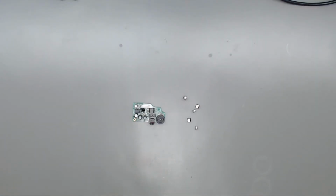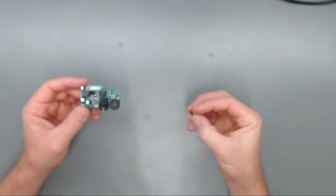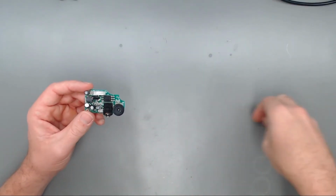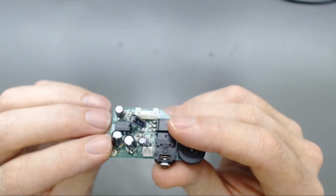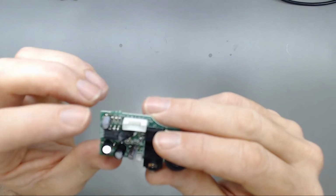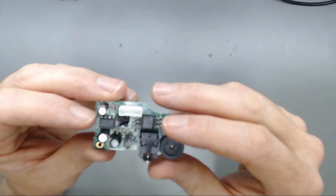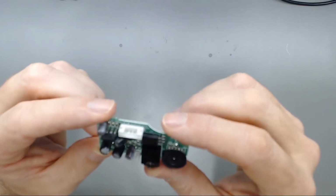Okay, we've got the audio PCB finished, removed all the old electrolytic capacitors, didn't have any problems with pulled pads or anything like that. I put all the electrolytic capacitors back on pretty much how the SMD cap set, so they're not taking up any extra space. And then went back and double checked just to make sure that I didn't have any bridge connections underneath. And everything checked out fine. So I like the way this turned out.